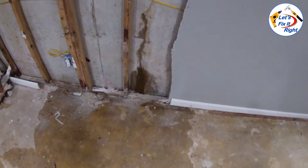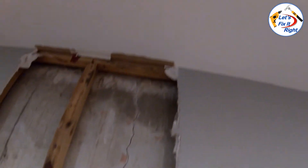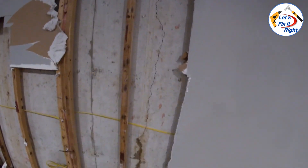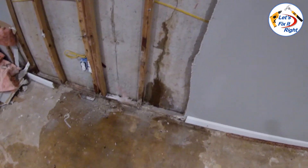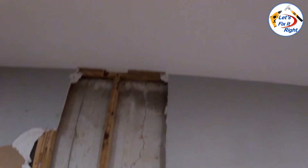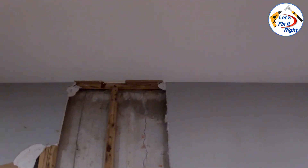As you can see, the majority of it is coming down here in this three to four foot area. We also suspect that the previous owner attempted to patch the foundation crack near the bottom and cover this area with drywall so the house would pass inspection just prior to Debbie buying the home. This fracture is most likely not from a footing failure below her concrete wall; her damage appears to be exclusively due to water damage with follow-on ice generated cracks from high stress concentrations and large forces from expanding ice within the crack.